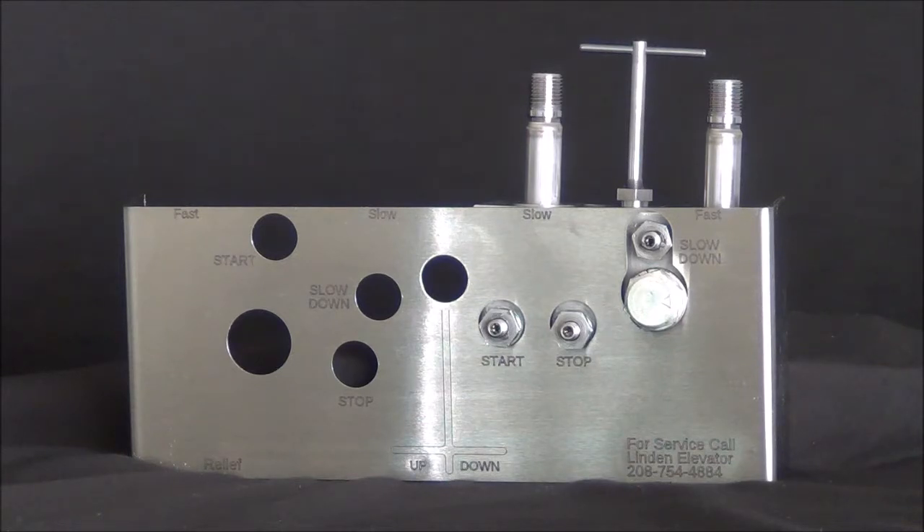This is probably the number one problem that occurs in Dover valves. They're an extremely good valve, but they're machined to a very high tolerance and they do not work well in a dirty environment. If you keep them clean, they seem to run almost forever.